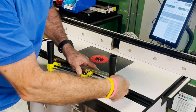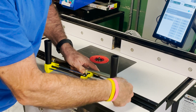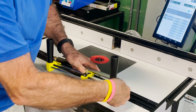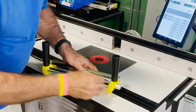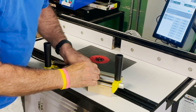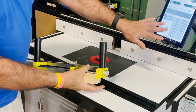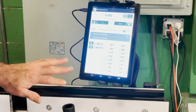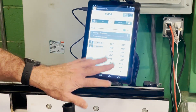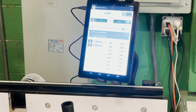We tension it in nice and tight, and now I'm going to put the safety lock on so it does not drift. We're going to use our power lift today, and the first cut we're going to do a quarter-inch height. It's a large bit, so we don't want to take everything off in one pass.